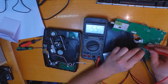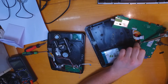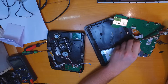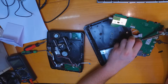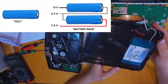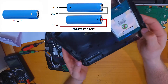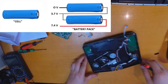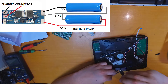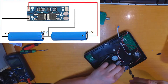When I measured it I got 5 volts, which was very unusual. I thought the battery was unstable or something. So I unsoldered the wires and found there are two cells in this battery — like two batteries glued together. That is the purpose of the white wire between the two cells. When you charge it, you charge each cell differently.